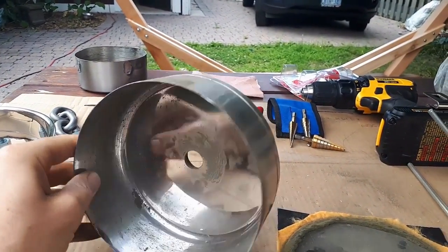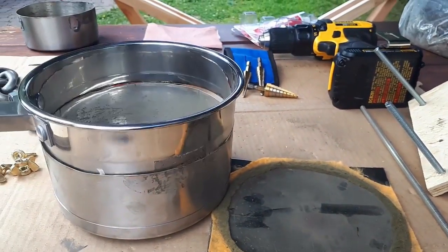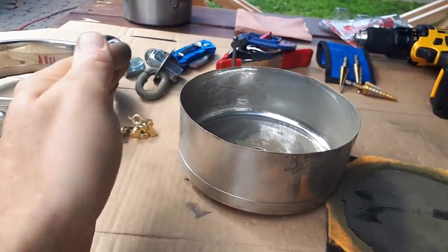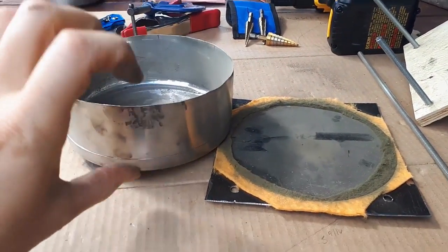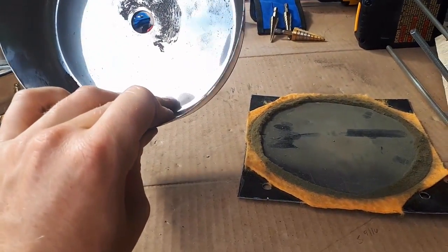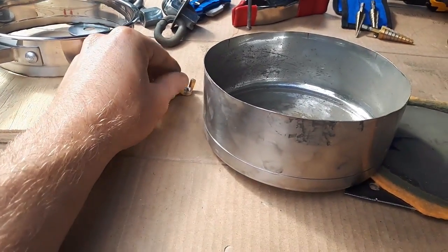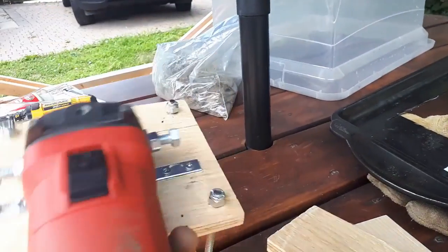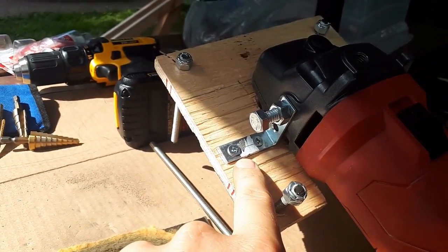This is pretty thin — it was actually just a pot I got from Canadian Tire. Basically you want something six inches internal diameter and you're going to cut it down to about two and a half inches deep, which is what I've done here. When you buy it, make sure it's at least two and a half inches deep and the sides are perpendicular — you don't want a pot that flares out or bells out at the sides. I went to a couple of thrift stores and just couldn't find the right depth, diameter, and straight walls, so I had to buy something new — about $23, by far the most expensive piece. You're also going to need some quarter-inch wing nuts to seal your lid down and four quarter-inch lock nuts that go on the back end to attach the crusher to the angle grinder.